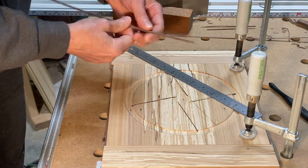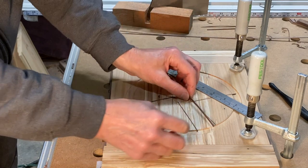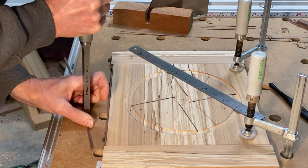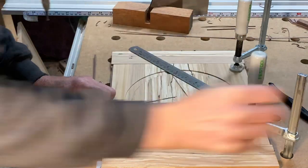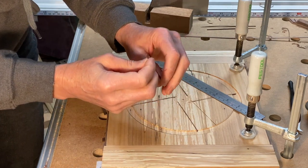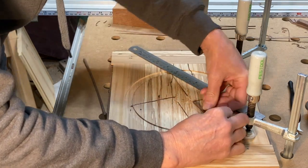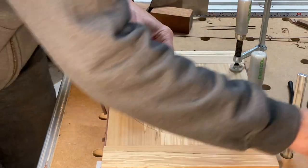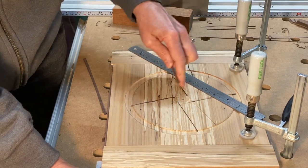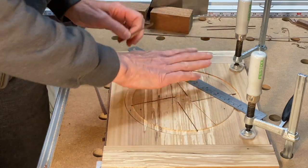The stringing is inserted as with the previous, where I have an edge that's been beveled. I'll cut off a length that's longer than what I need. This stringing is even narrower than the other I was using — this one is .032. I like to check that it's going to actually go in before I start adding glue. This looks like it could use a little bit more chamfer on the edge. I'm not going to glue it in yet because I want to do the other lines so I don't have to deal with raised inlay getting in the way of my scoring.